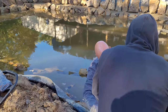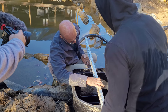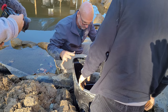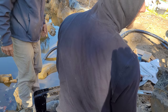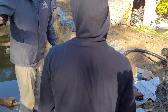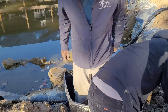Yeah, that back end's got to come up. More gravel? Yeah, we're probably pretty good. Let's get it level that way. All right, so now what we want to do is get a little bit of soil around there just to hold it in place. I'll step inside of it — that'll keep it from shifting. Otherwise when we start filling it, it'll get knocked out of there. All the dirt around here is clay. So we'll use some of the soil for the sides — clay will hold it better.